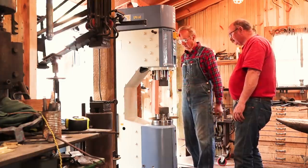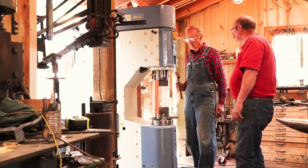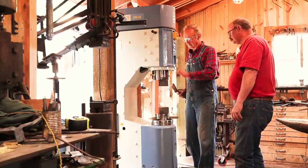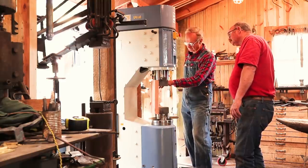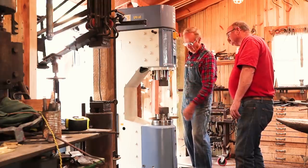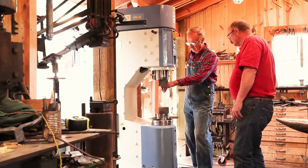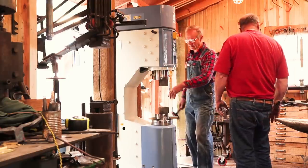You don't want these to come loose, and usually a little bit heavier hammer is probably good, so you really drive them in. And if this be the lighter hammer, you'll hit it harder, and this will mushroom up a little more. And they will mushroom up because I don't think they're hardened. Every once in a while you kind of sand that down.